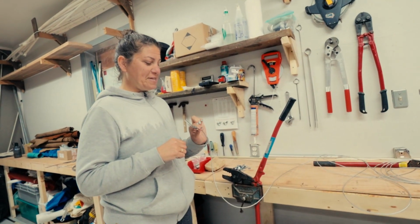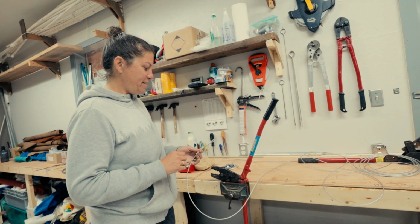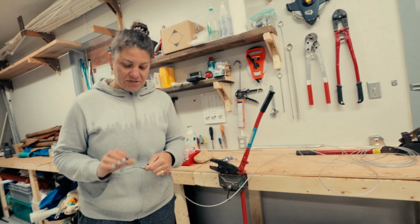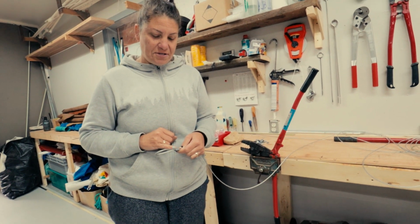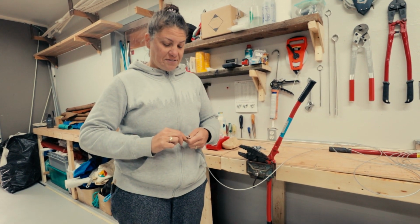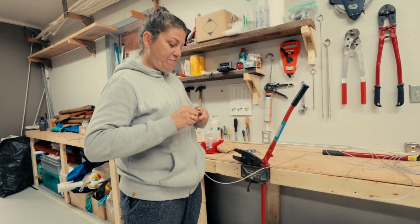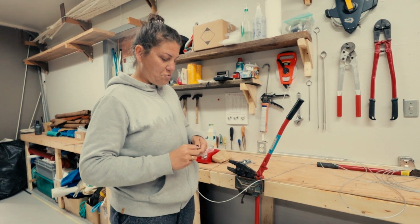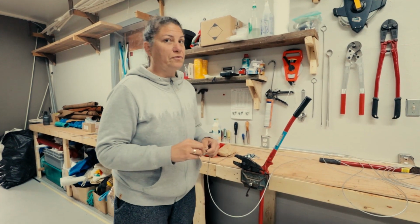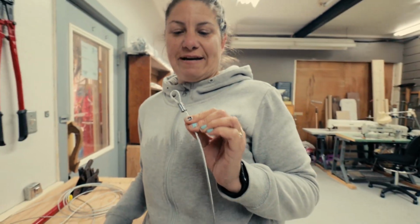These are NicoPress crimps. They're a nickel-plated brass. And basically, you've got your crimper here set up. What you're gonna do is put 2 crimps in it. Some of the larger ones will do 3. And as I was just telling Simon, there's 2 schools of thought on making your crimps. If you go in the Vanguard book, they say to leave about yay much sticking out. I've always been of the school of thought that you want it to suck in as you crimp. That way it doesn't catch on things like sails, rigging, that kind of stuff.